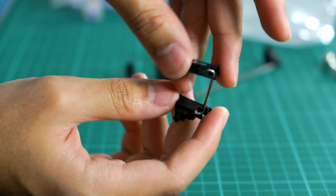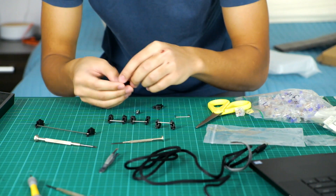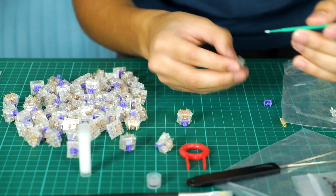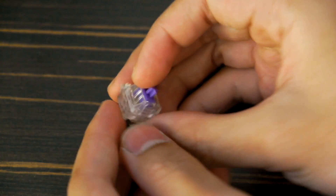It's a common practice in the community to clip these for a smoother experience and sharper feel. You have to first slowly open them up, find the L shape on the stabilizer, cut that off, and then put it back together. You have to do that for each and every stabilizer. And now for one of the most tedious but rewarding processes: lubing the switches.